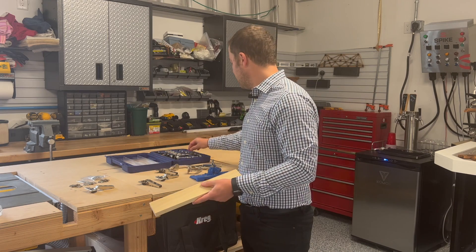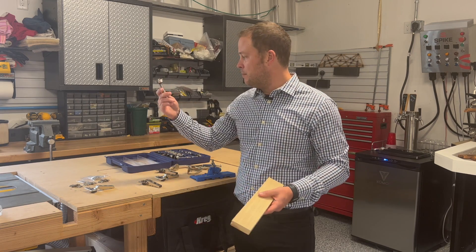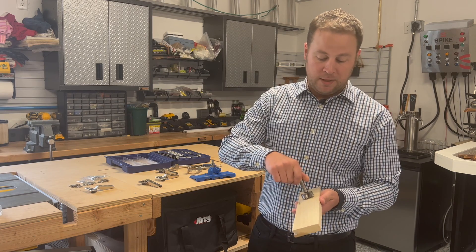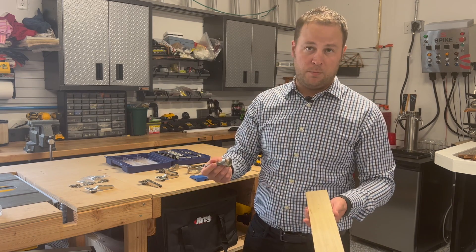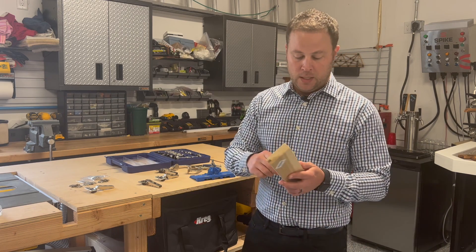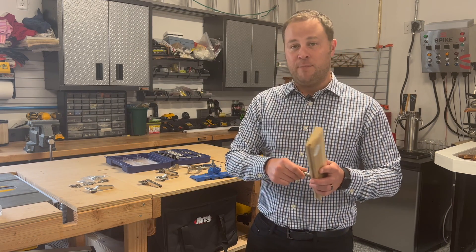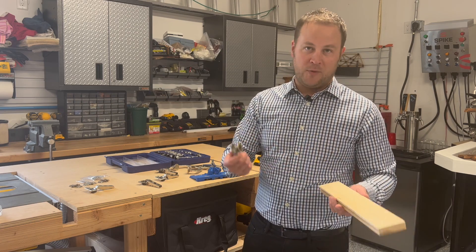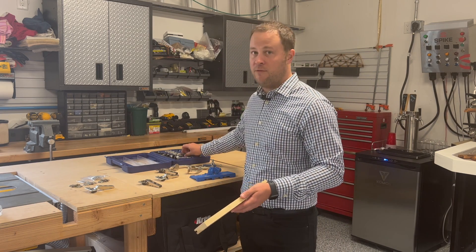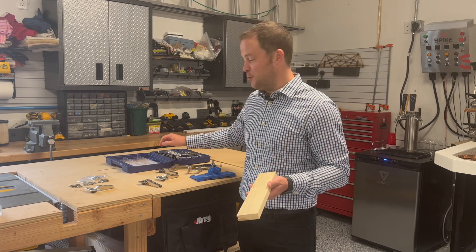While I'm drilling the hole, I typically grab my 1 3/8 inch bit out of my kit and drill the hole — and who knows if I'm steady because I just use my drill. I don't use my drill press, though I probably should, but that would just take too long. So there's some variability as far as whether I'm putting the hole in the right spot, and I often end up with very questionable hinge holes.